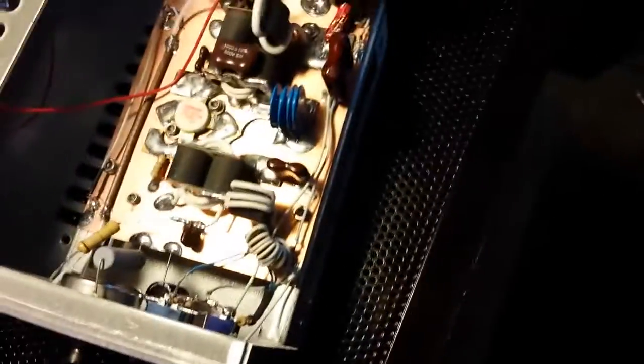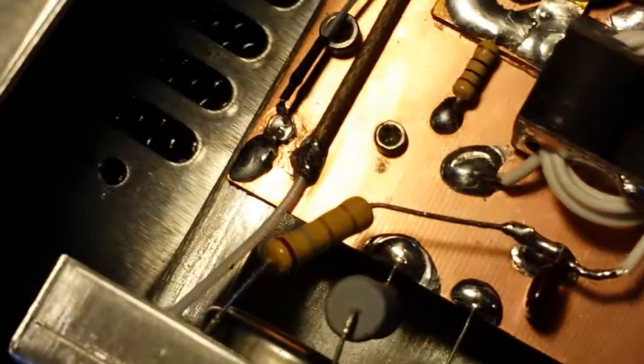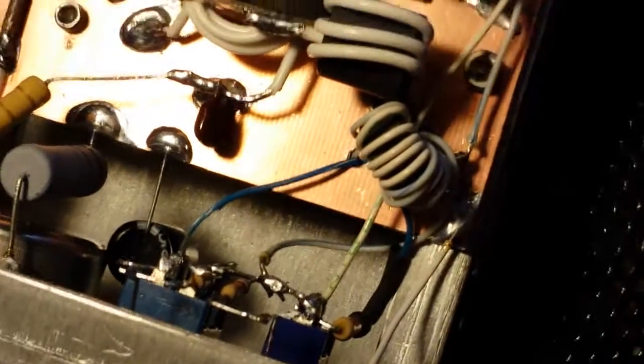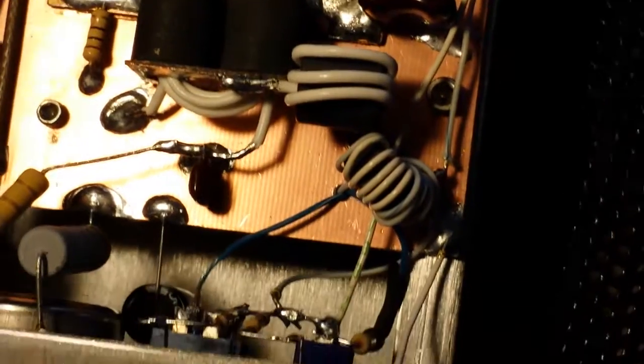Let's see if I can zoom in and show you the ground effects. Here's one right here — see that? It's a 3 millimeter blue LED. Here's one on the other side. Same on the other side. I think next I'll try one with 3. I'm trying to keep it as clean as possible, with as few wires going over the board as possible. We've got four wires just out here, and all of those are hidden up under the board. Here's your 2.2 kilohm half-watt resistor that's limiting all four LEDs at once.